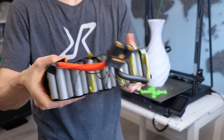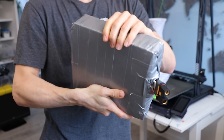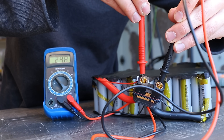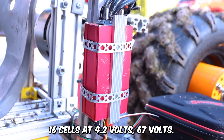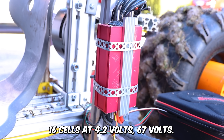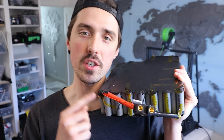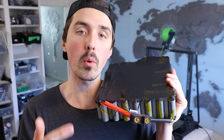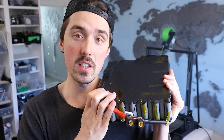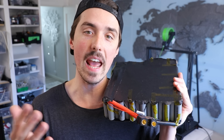These are the batteries that I covered in duct tape. Each module contains 196 cells and the voltage is 26 volts, and it can output more than 200 amps. As the electric speed controller can only handle 16 cells at 4.2 volts — 67 volts — we can only use two out of the three batteries in series. Because of the configuration, the max voltage of just one module is 29.2 volts times two modules, that's 60 volts, which is pretty close to what the controller can handle.